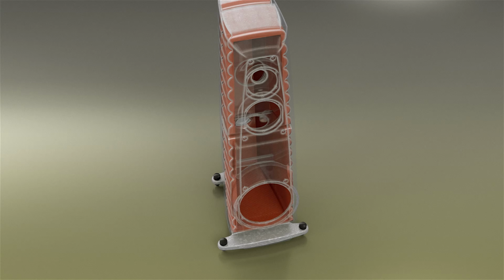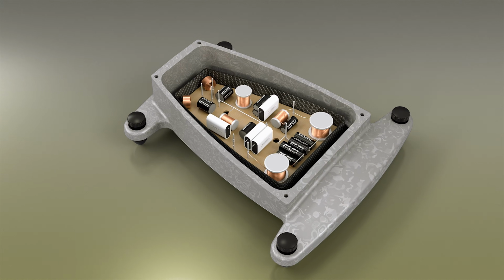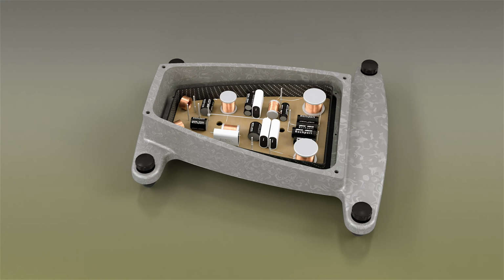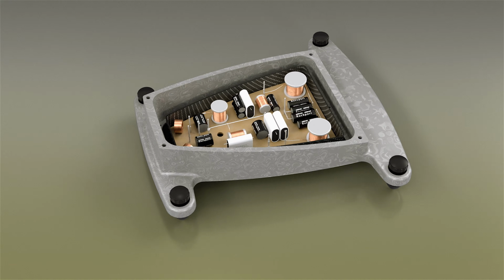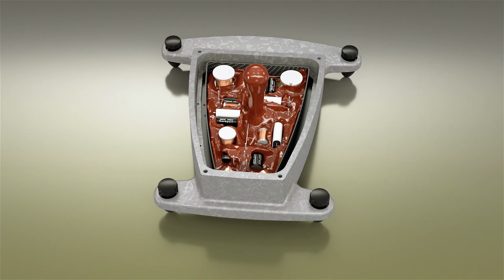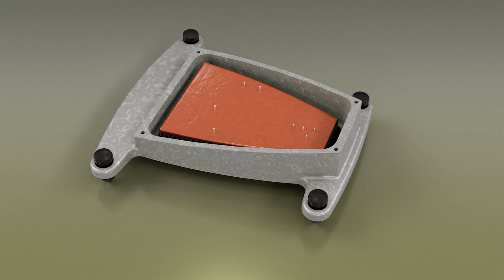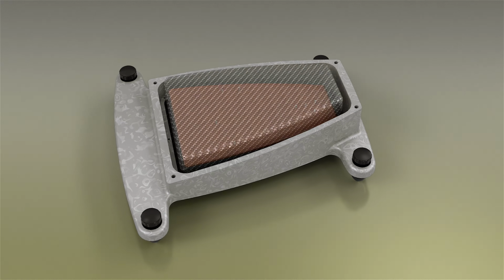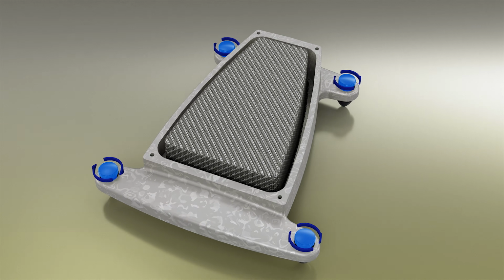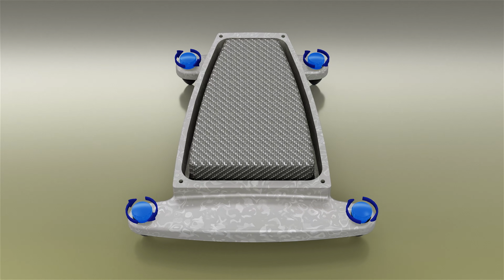The LYNX also features a one-piece cast aluminum base and outrigger assembly, which houses the crossover network in its own acoustically isolated compartment. This ensures the individually calibrated, point-to-point wired, and fully epoxy encapsulated crossover network is never subjected to any acoustic vibrational energy from within the enclosure, further enhancing the loudspeaker's transparency. Machined aluminum feet with integral lock knobs allow for easy adjustment of rake and leveling, simplifying loudspeaker setup and optimization.